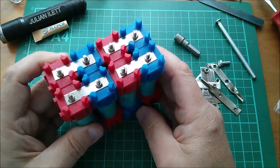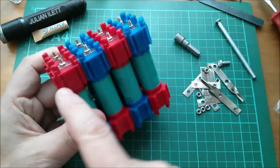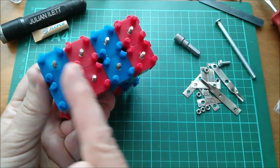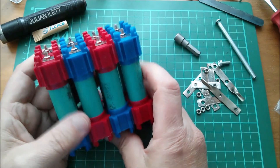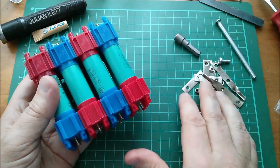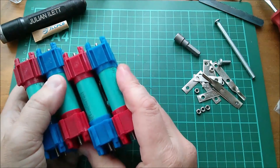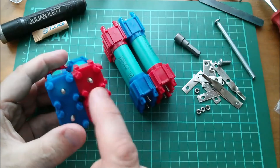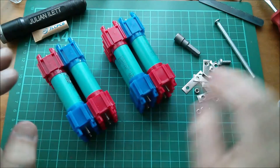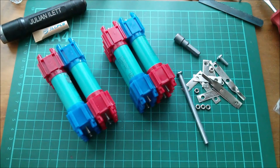And that is my finished configuration for 4S — four cells in series across here — 2P parallel. But before I start putting the nickel strips on, I want to get my barrel bolts in. So I'm just going to slide these back apart again, and I'm going to work with these square modules to put these barrel bolts in, because it's the easiest way to work.